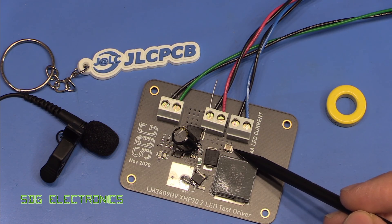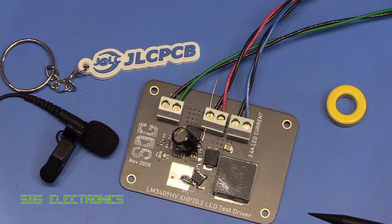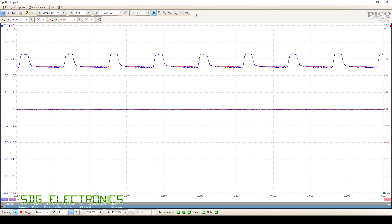Now I have a question: how much current are we actually seeing going through this ceramic capacitor? What we're going to do is solder a 1 ohm resistor in series with this capacitor and see what the waveforms look like. Unfortunately we don't quite have enough resolution on this PicoScope to infer the current by having a probe either side of a 0.1 ohm resistor, and because the AC range is broken on one of my channels I can't use the maximum dynamic range of the PicoScope.